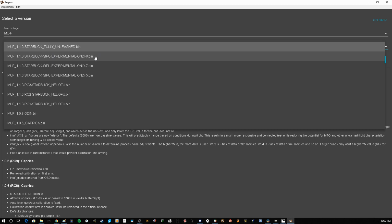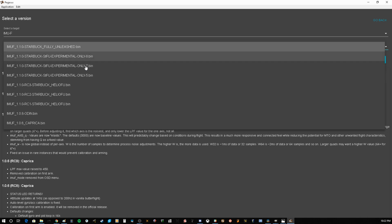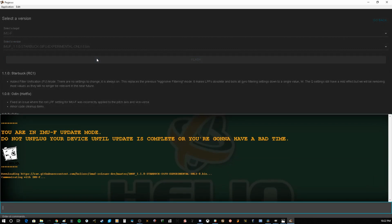I'm a tester and pilot, so I'm going to go ahead and try experimental number 8. We've been having really good success with 8, 7 as well. But these are test versions for us to check out. So we're going to go ahead and put 8 on here, and when you select it, you're going to hit flash. And again, it's going to do its thing. It's going to talk to the IMUF, download the latest build, and put it on the IMUF chip.